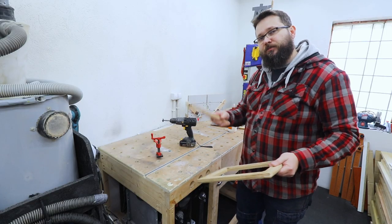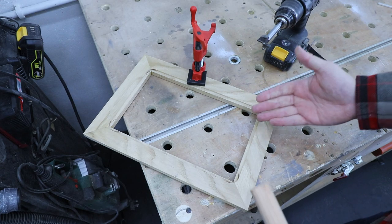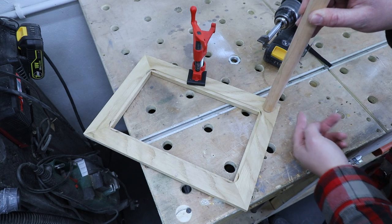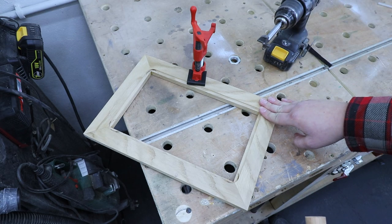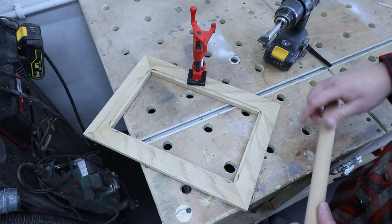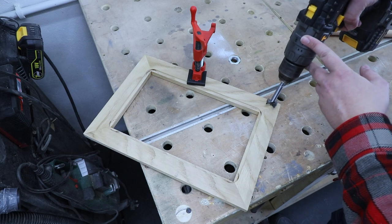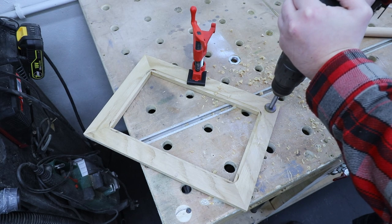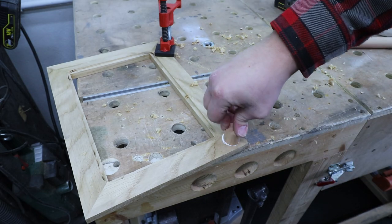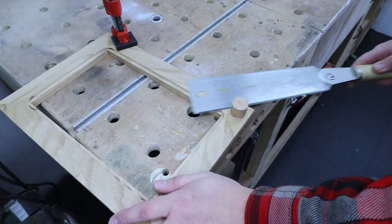Now it's time for the next option. You're going to need a dowel and a Forstner bit that will be the same size as your dowel. That's the back of my picture frame, and as you guessed, with the Forstner bit we're going to create a hole through which the dowel will go — glue it in place, cut off the excess — and that's going to reinforce the back of our picture frame. You can drill the hole through and make a feature out of it, but I think it's best to have it at the back so it's not visible. Let's make the hole, add some wood glue, add a clamp, and now we're going to wait for the glue to set, then cut off the excess and sand it out a little.